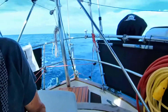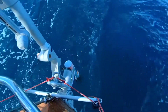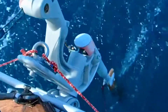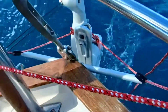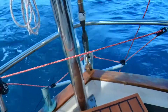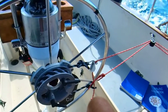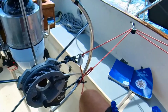So let's look back here. Down in the water is the wooden small rudder. As the wind changes across the stern of the boat, the little rudder turns side to side. It moves the arm back and forth, which pulls the red line, which goes through some blocks and connects to the wheel. As the rudder goes back and forth through the water, it's pulling the red lines and changing the course by turning the wheel and the big rudder.